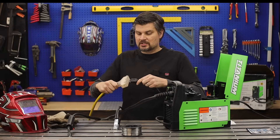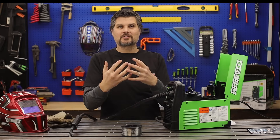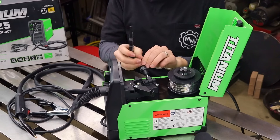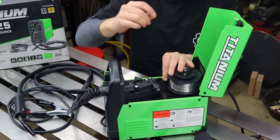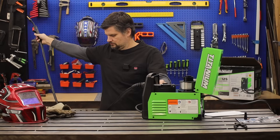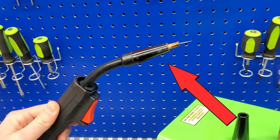We need to run the wire through the gun, so plug the machine in now. But if you're on a metal table, take off the ground clamp first — if you pull the trigger and touch the table, you'll close that loop and create an arc. Ensure the wire diameter on the feed roller matches your wire size. While holding the wire securely, cut the end — and do not let go, or you'll lose half your spool. Don't forget to turn it on. I like taking off the contact tip just to make sure the wire flows out freely, then press the cold feed switch or pull the trigger. Once the wire comes out the end, put the contact tip back on, then the nozzle — and this is a true flux core nozzle, which I love about the Titanium welders.